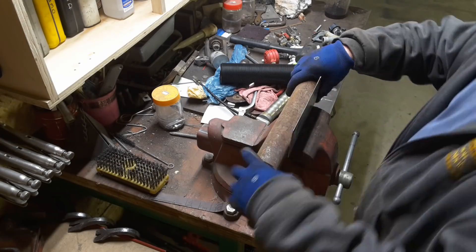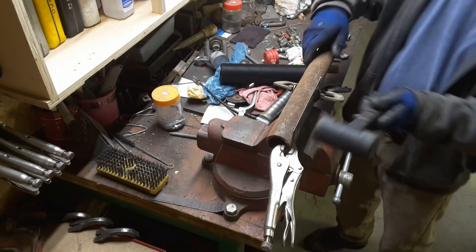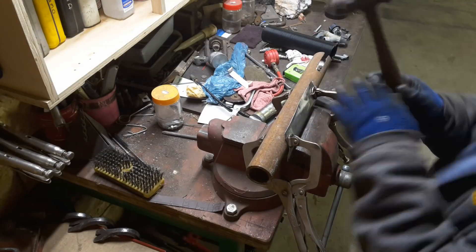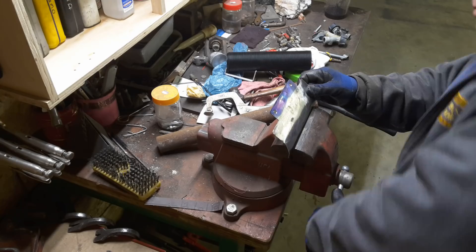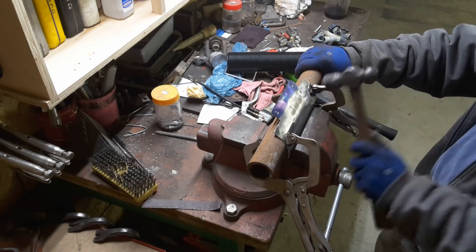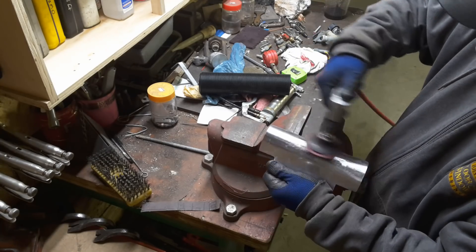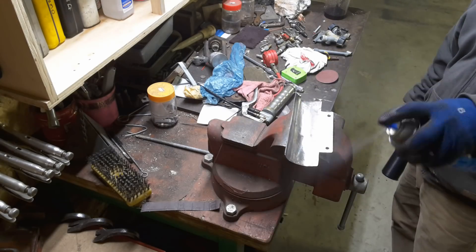Next thing was to go to the bench vise and got a little creative with a piece of pipe and some clamps, and bent it around until it looked right. It took a couple of times going back and forth until I got something that I felt would hold the hose without it rolling around. My plan is to use velcro strapping to hold it in, at least at this stage. I removed the hammer marks and vise marks with a Scotch-Brite pad, then sealed the metal so it wouldn't rust using my favorite technique — ignition and battery sealer. This works awesome.